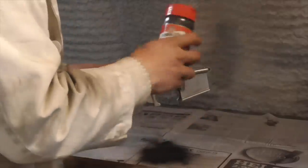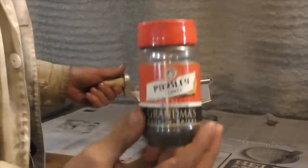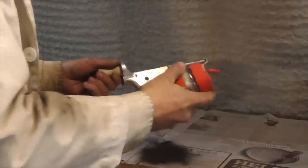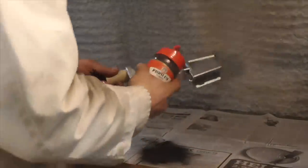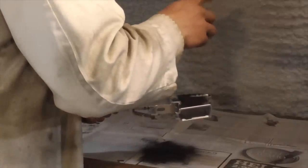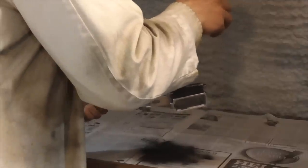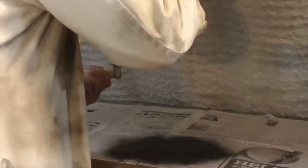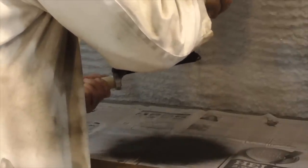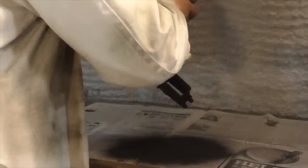Then I'm ready to apply the powder. In this case, I'm using Eastwood Hot Coat Semi-Gloss Black Powder. To apply it, I simply put some powder in an old salt shaker — or rather a previously emptied bottle of parsley flakes that has a shaker top on it. I sprinkle the component generously with this powder and then tap it lightly to knock loose any excess, leaving a uniform coat of powder adhering to the WD-40 film.